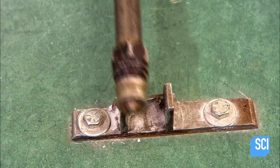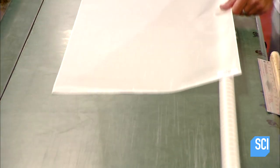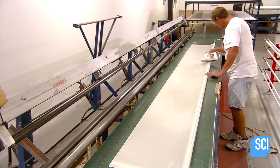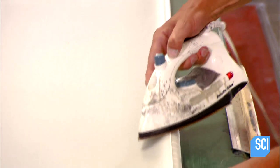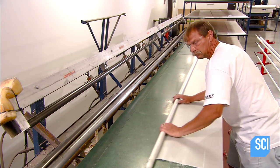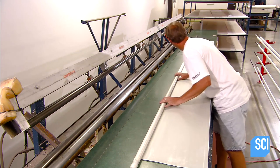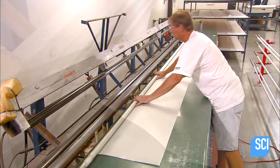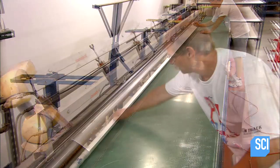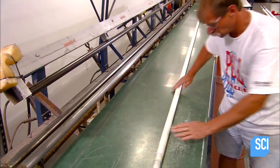For the next layers, they remove the mandrel and lay it on a table. Now it's time for those fiberglass patterns they cut earlier. They heat the edge of the first one with an iron, melting the resin in the fiberglass until it's tacky. They stick this edge to the mandrel, then slide the other end between heated rollers. The rollers wrap the rest of the material around the mandrel, the heat activating the resin in the process.